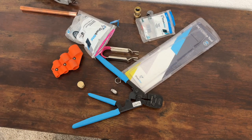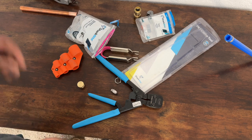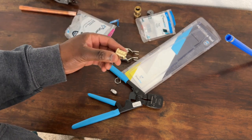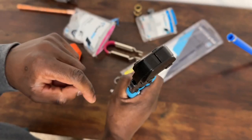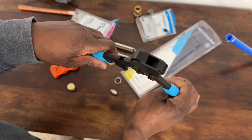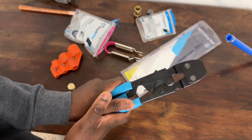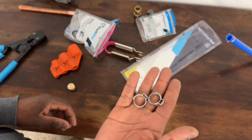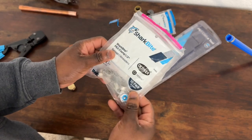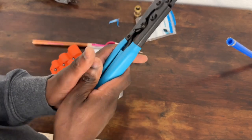Next time I'll get an actual copper connection going into PEX so you can see the full crimp. But this is the tool - it opens like that and closes to crimp. When it closes it crimps, and when you open it there's that gap. These are the tools you'll need to invest in if you're going to be doing plumbing. I love these clamps - this is half inch, so for three-quarter pipe you get the three-quarter diameter clamps.